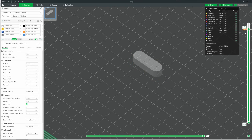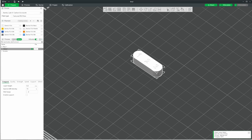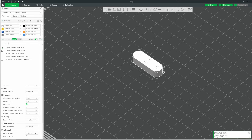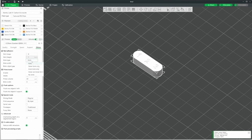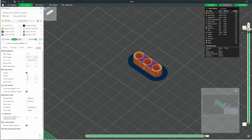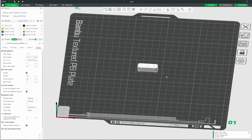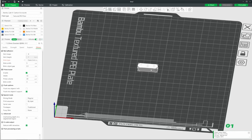What the pause does is add some G-code that pauses the print, sends the print head to the back corner so you have room to work, and then you can drop your magnets in. Because this is a small print and I don't want it coming off, I also want to add a brim — I'll go to Global, search for brim type, and set that to outer brim, then slice the plate again. Now it's got a brim on it, it pauses, then continues. We also need to make a second one of these so they can magnetize together, so we're going to clone it once.